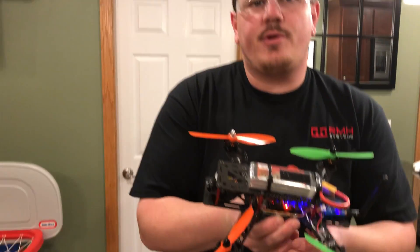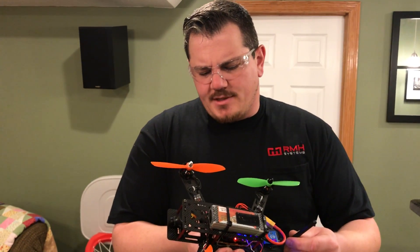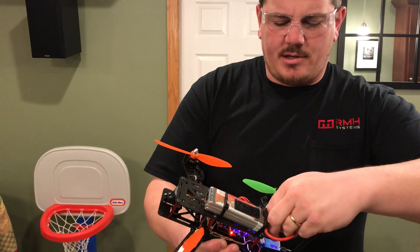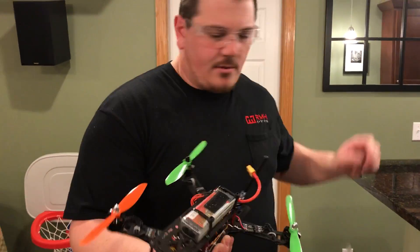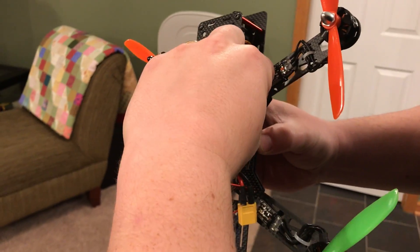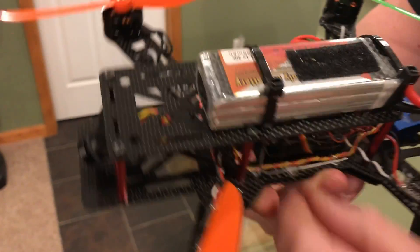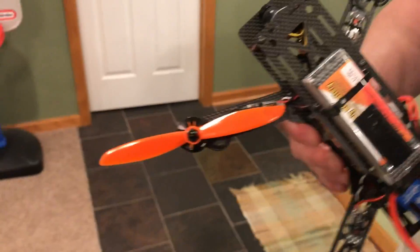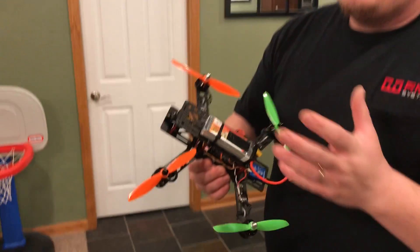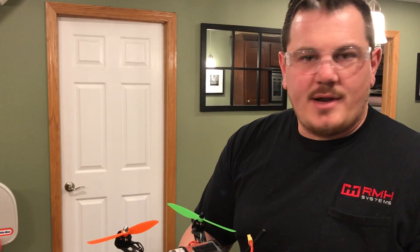We've got a Naze 32 version 5.0. We had a problem with our 6.0 board for some reason. We're using our Spektrum satellite right here. I'll just unplug this so we can be on the safer side — okay, so it's disarmed totally now. You can see here we put a little collar to kind of keep the antennas in there. This carbon fiber doesn't allow the radio frequencies through very well. I don't like diversity antennas parallel — ideally they'd be perpendicular to one another at a 90-degree angle.